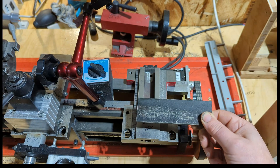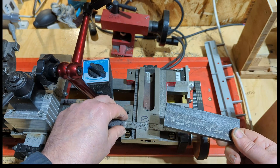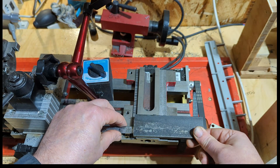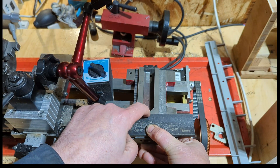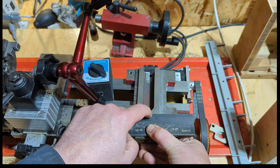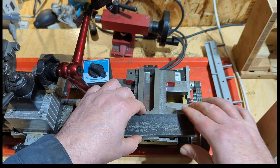So having something that allows this to pivot is the problem. What you need to do is find the exact right shim, and when you bolt that thing down there, it's not going to have anywhere near as much ability to rock. That would be the first thing that I would suggest.